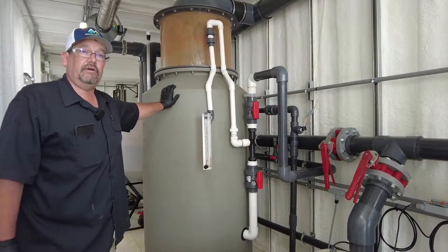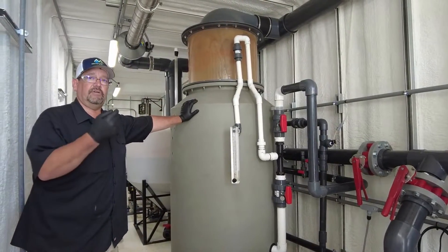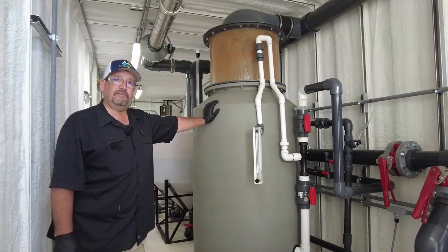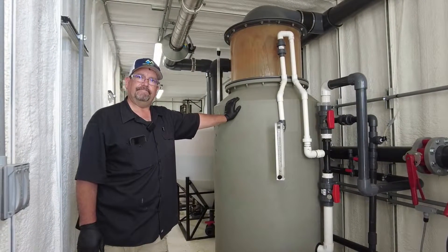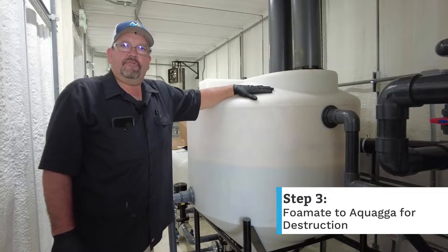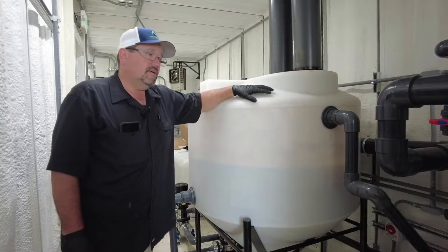In stage two raffination, we strip out more of the PFAS that might be left in the water. The raffinate from this unit then ends up going to the tank at the very end of the trailer, which gets pumped out to whatever disposal source we need. What we're left with is foamate — highly concentrated PFAS that we've removed from the water.